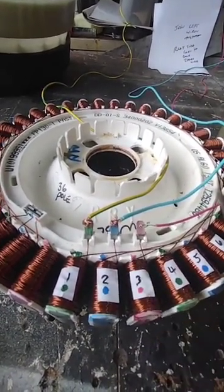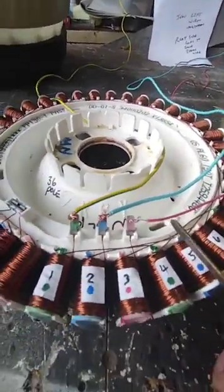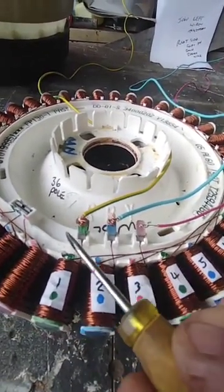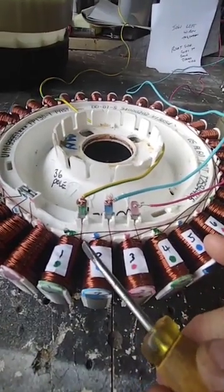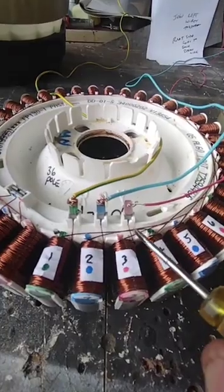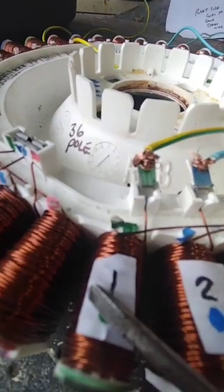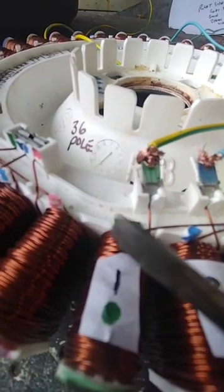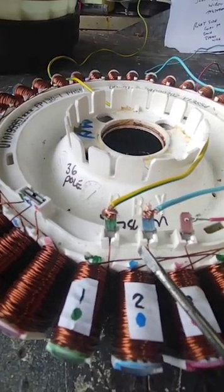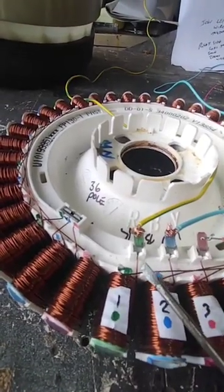What we're going to do is rewire this from a high-voltage motor to a lower-voltage motor. We want to get about 12 to 13.75 volts — more than 12 volts because we need to charge a 12-volt battery. I'm going to cut this video off and in part three I'll cut all these wires and have them standing up, then show you how they join together. Some of these motors use copper-clad aluminium wire because copper is expensive.